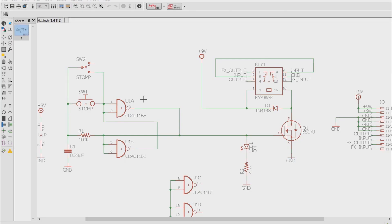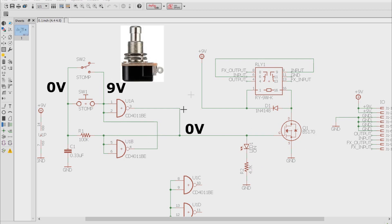If you get a really bad or dirty switch, you may need to increase the capacitance to extend the time constant beyond 33 milliseconds. Now let's understand how voltages control things on this PCB. When we first give it power, pins 1 and 2 are driven high — that's how they're initially supplied voltage — which forces pin 3 low per the NAND truth table. This holds pins 5 and 6 low, which forces pin 4 high. With the stomp switch open, you have 0 volts on one side, 9 volts on another, and 0 volts feeding the output — ultimately making that output 0 volts as well.